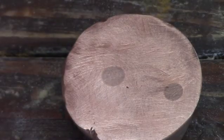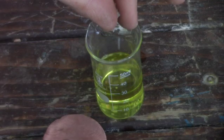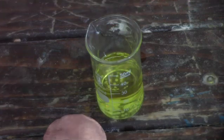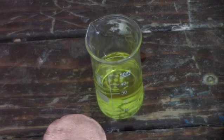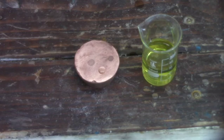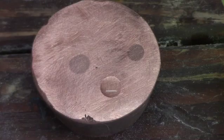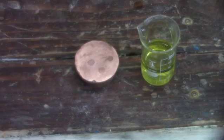In this experiment we're using urea to denox our solution, so we're adding a few urea prills and we'll let those dissolve. In my next video I will be using sulfamic acid instead of urea to see if the outcome is different. After our first denoxing procedure we'll do another drip sample — the solution seems to be turning green, meaning we still have excess nitric acid in our aqua regia. Our next procedure will be to add more urea and then test again for nitric.